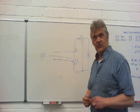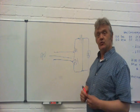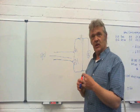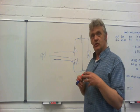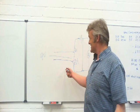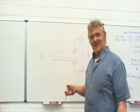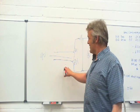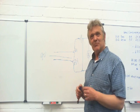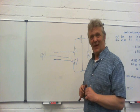What we did was swap the battery leads over. As we had the battery leads in one position, we got one resistance reading. When we swapped them over, it changed the resistance reading. And what's more important, the resistance reading was 30 ohms apart and stable. So we have here an ink system for painting memristors. Obviously that's a bit rough and ready, so there's an awful lot of things you could do with that. But I think this is a basic system that could be explored for developing memristors much further than I've already done on the bench top with a clamp and a bit of a battery.